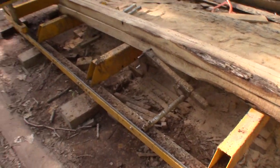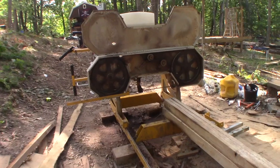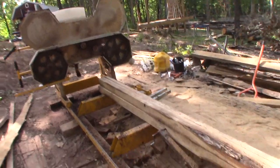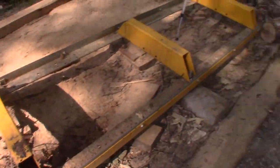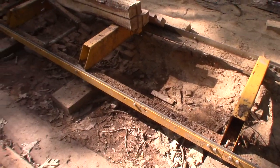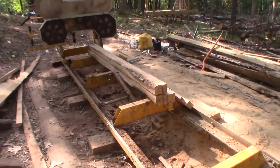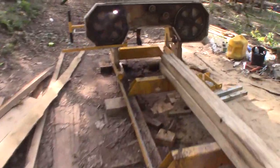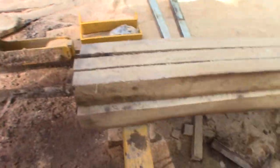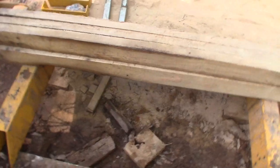This particular machine as well, a little bit of specs on it here from the factory. You can go ahead and cut 11 foot with it straight out of the box. I went ahead and ordered one additional log bunk, which gave me 7 more feet, so I can cut up to 17 foot, I believe, 17, 18 foot, something like that. I think it's 18 foot, but we don't push it, because that would make it to where you're actually shoving the log right back against the blade and getting started. Whereas if you start it right here and run it clear down to the other end where the saw can go, it's 17 foot, which we actually did yesterday, and it works fine.